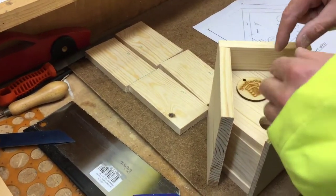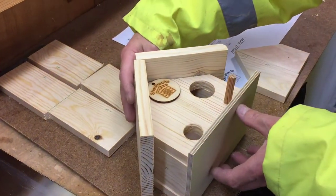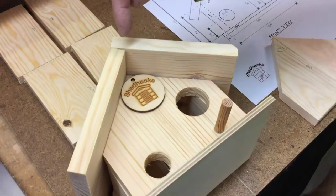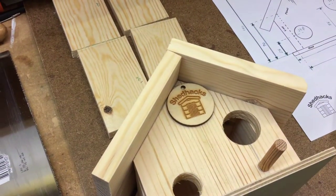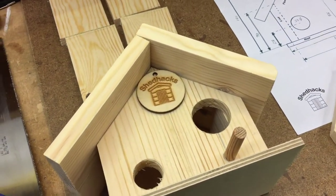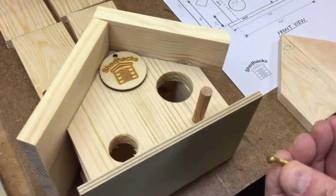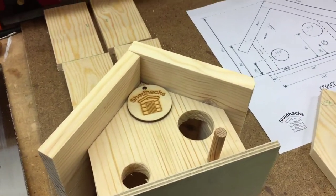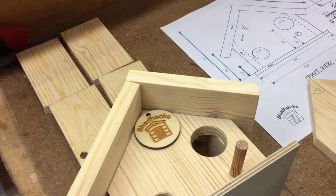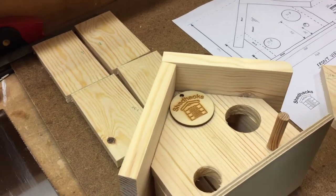Mustn't forget - the birds will know to subscribe. We'll close that gap up there by planing that so it's square, and we'll glue it with some PVA. And I will put in some wood screws - we may use some little brass ones even, countersunk. A smaller version - and they'll go into there. So if the box becomes damp and the glue deteriorates, the screws will hold it together.